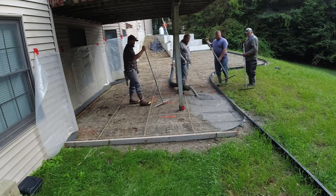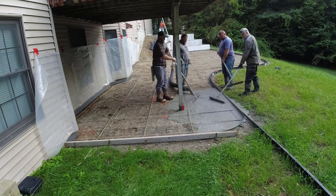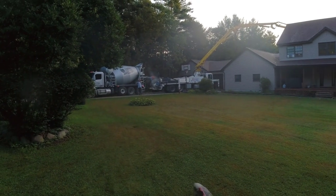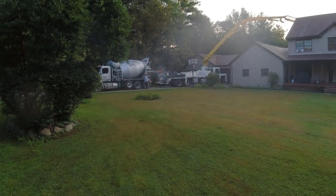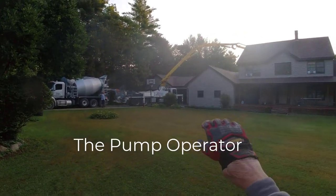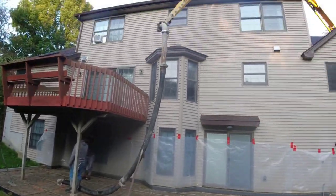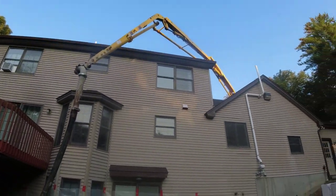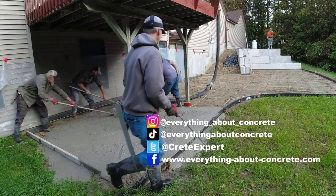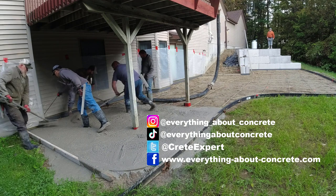Welcome to part two where we're pouring our concrete patio with those curved flexible concrete forms. Right now we're pumping concrete over the top of this house. To do that, the dispatcher has to mix up some bags of Portland cement in his hopper with four or five five-gallon buckets of water — that's what greases the line and allows the concrete to go through without plugging it up.